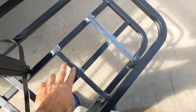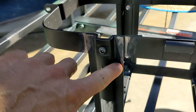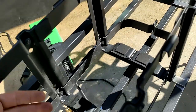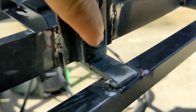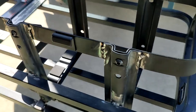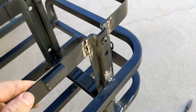I've got my 10-inch pieces of steel cut so I can bridge the gap for the jerry can holder. I'm going to tack weld a few spots here — I think this is what welders call stacking dimes — just in case the screw comes out with vibration; I don't want the whole thing to fall apart. These are going to be my mounting points for where the carrier meets the crossbar. I tacked the metal handle in case the screw backs out from vibration, and this is where the support bar joins the hitch carrier. The jerry can fits.